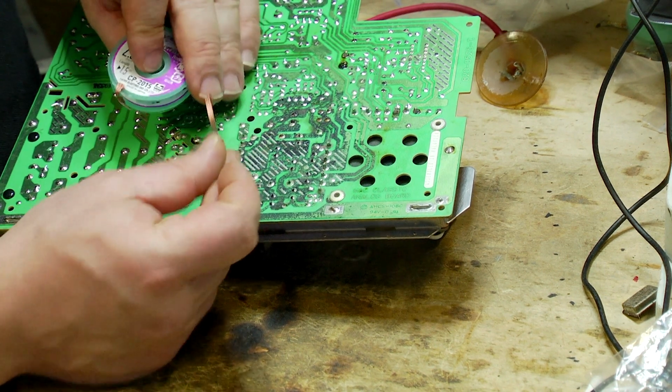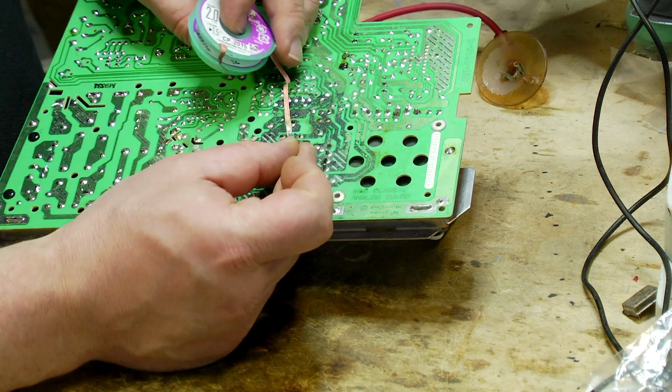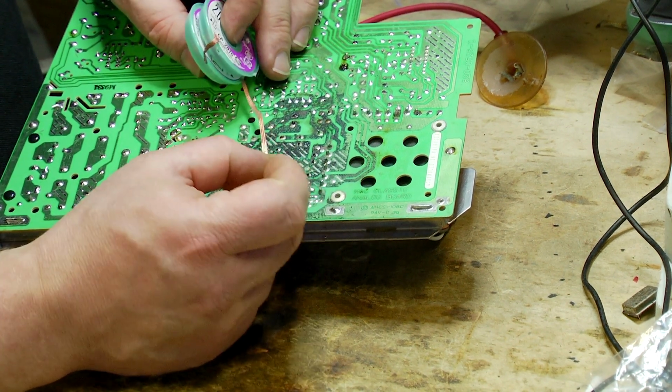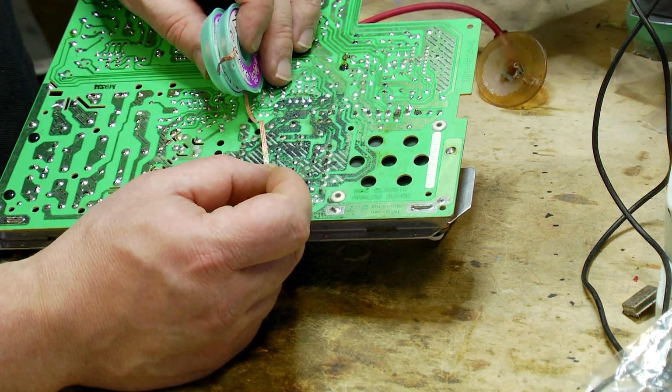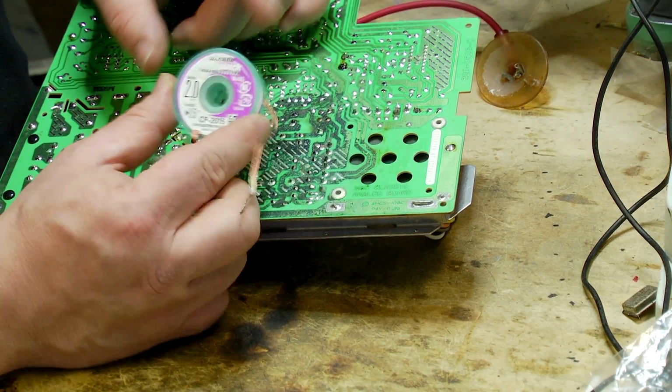You apply heat. It's basically braided copper with some flux in it, and you can apply heat, and this sucks up all the solder and that draws it away. Solder wick is readily available and nice and cheap. There are links in the description.